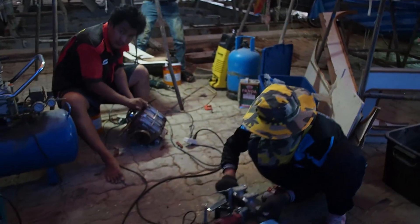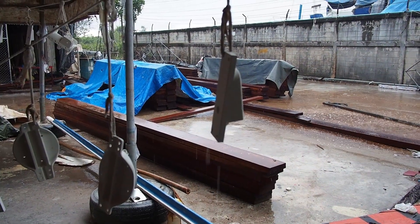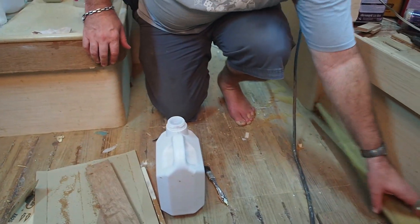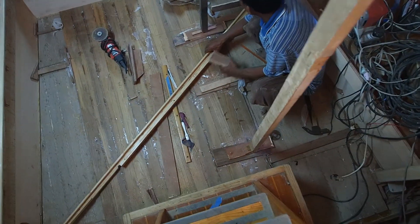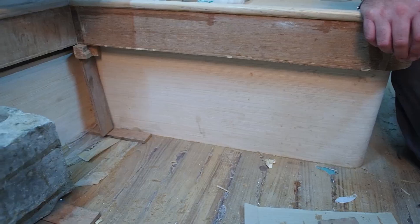The work has continued unabashed under the glare of a single fluorescent light. One of the biggest steps of progress we've made this week has been the floor — we hinted at this in the last clip. We've taken six millimetre layers of teak, removed the old veneer off the sole boards and we're sticking this down, taking it right to the edge. Our head carpenter Pom has been finishing this off beautifully. Once he's finished we'll sand it and put a few layers of polyurethane down to protect it.